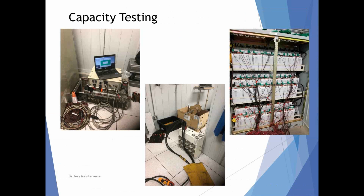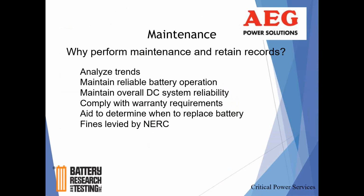And this is what a load test looks like. Our monitoring system is the snapshot to the far right-hand side. These tests usually run 3, 5, or even, we've seen them, 8 hours. Because you're running a test on 92 cells, to manually run through with a voltmeter, and we've seen people try to do it, by the time you get down to jar number 92, it's time to get up to the top and start over again. So you're not really capturing in real time where the individual cells are or how they're performing against the clock, as it were.